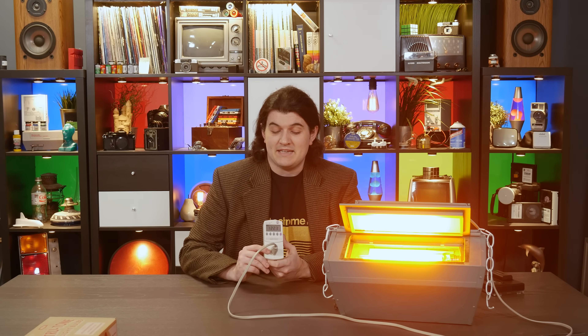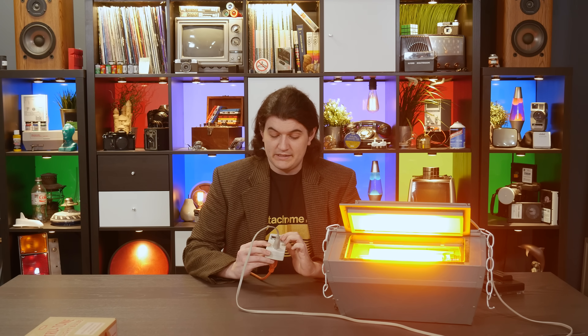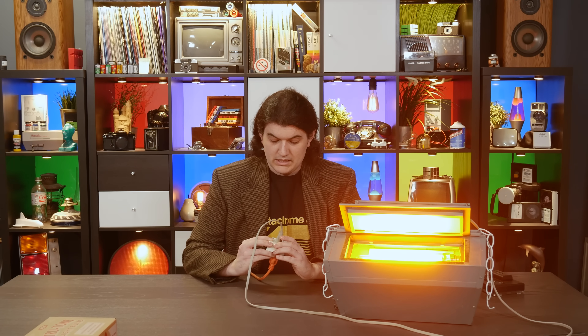When I plugged this into the Kill-A-Watt — which was just for curiosity's sake — I realized this is nowhere near as efficient as it would appear to be. The label actually says Bulb Power Consumption 35 Watts — it's a 35-watt bulb in there. However, if you look at the Kill-A-Watt, it is actually drawing about 72 watts, more than double that, which is surprising. A lot is being lost in the ballast.